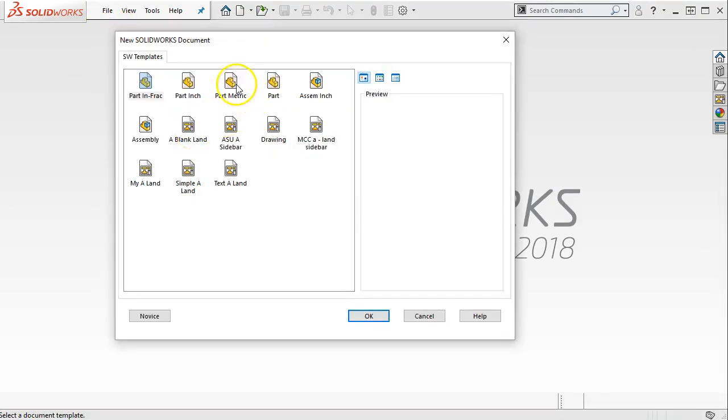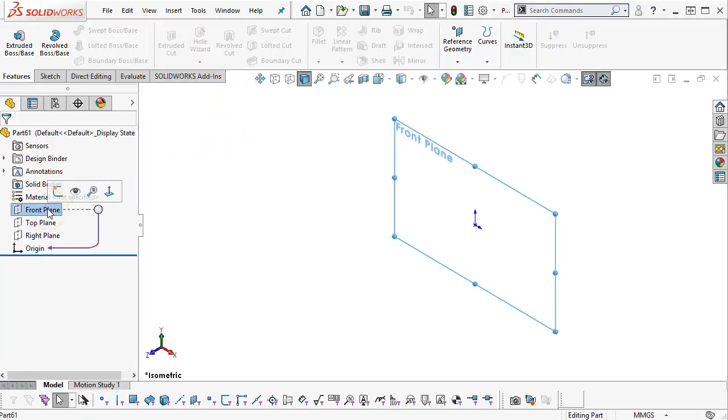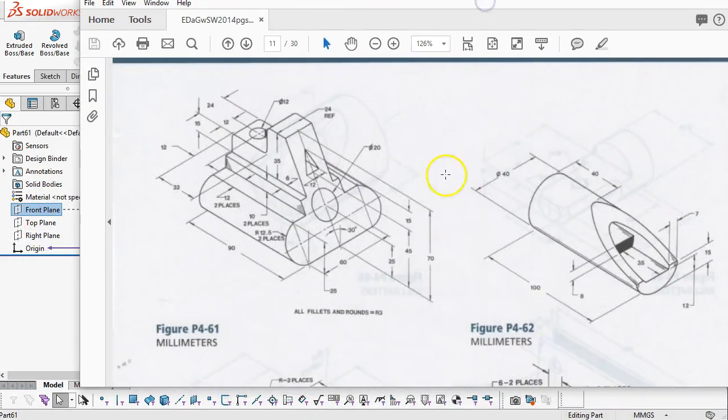This is a symmetric part. It has symmetry about the center line. We know from past experience, if we want it to look like the model, we're going to go to the right plane. I don't think it's critical, but there's a diameter of 20 going through, assuming that is normal to the end face. The triangle intersects back here, so it either terminates at that face, which makes it a sink EDM piece of geometry, and then being a triangle, it's already a challenge.